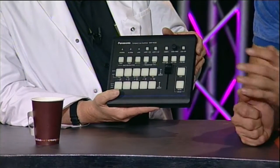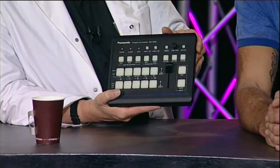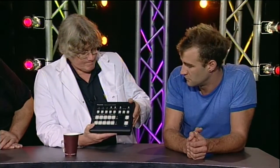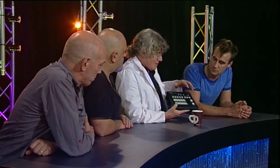As well as the frame memories, it's also got some picture-in-picture functionality and it's switching between four or five cameras and another source. But it does rely on shift functions so that each key may have several functions, and you can't just press it and expect it to work. You have to see what mode you're in and then press things. So it'll do a lot of clever effects but not all of the things all of the time. You have to very carefully evaluate what you're doing when you assign it to a job.